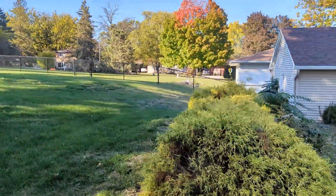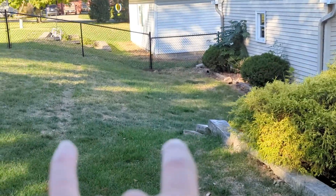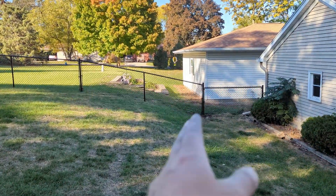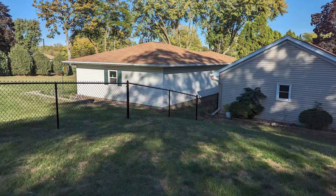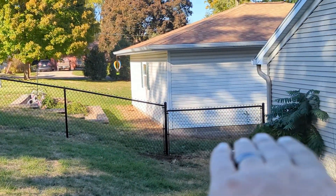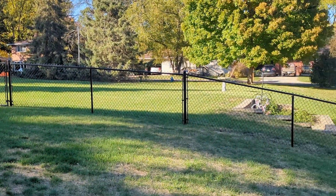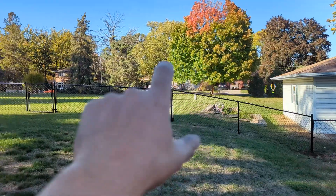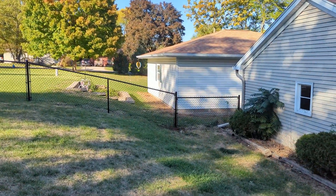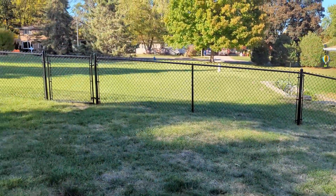The next section, we came off the garage edge and you'll notice this is a pretty good hill. We had to do what's called a bias stretch to stretch that fabric up the chain link run. You need to add in relief posts because if I had started here and gone to that edge at the gate, the chain link does not want to make that hill. So you absolutely have to put these relief posts in to maintain a tight stretch, keeping it close to the ground.